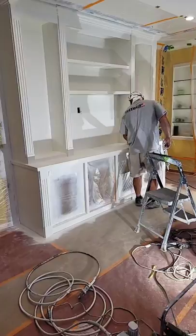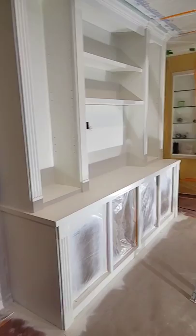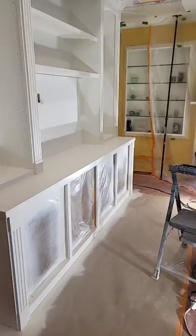We already put one light coat on it already, and I'm getting ready to shoot the second coat. I'm going to hand the camera over to Eddie and walk you guys through the process of how I would shoot one of these entertainment centers. This is the first time I've ever done it live, so bear with me. I'm going to try to talk my way through it, but I have to go a little bit fast so that we keep our line wet the whole time.